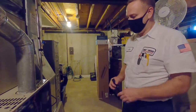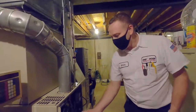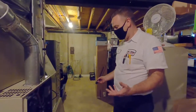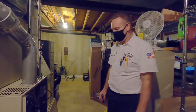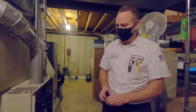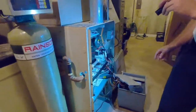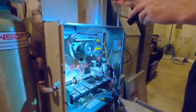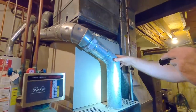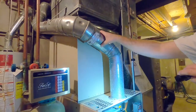We take safety seriously. We want to make sure the flue piping, gas piping, and heat exchanger are all safe in the home. I'll put things back together, make sure everything starts back up, and check out the rest of the safeties — the gas lines, the connections — to make sure there are no gas leaks. We also check that the flue piping is not soft or brittle to the touch, because if it is, it's breaking down.